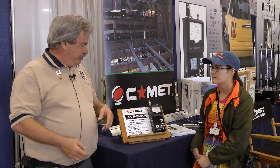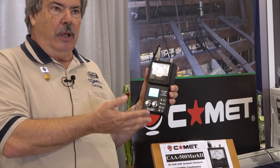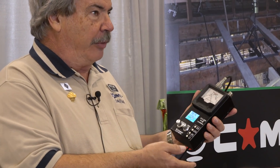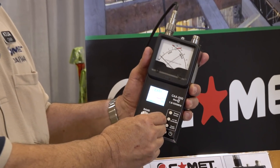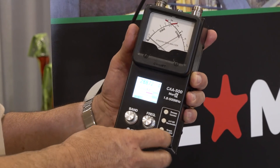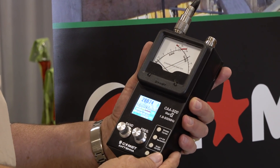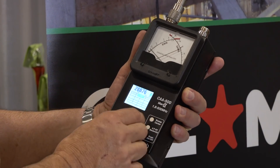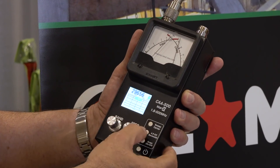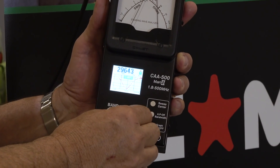We hook up the coax, we've got to test the antenna. And that's where an antenna analyzer comes in handy, because an antenna analyzer will show you how the SWR is doing on the band that you're designing the antenna for. We have a portable antenna here. What you would do is set up your analyzer and start sweeping it. You can see the meters sweeping, and you can see that our resonant frequency is 28.8 megahertz. That might be a little lower than we want, but at least we have a starting point. This tool will not only show on the meters, but it has a graphing mode, and so you can push a button and set your sweeping range, and then you can paint a plot.